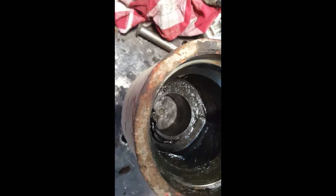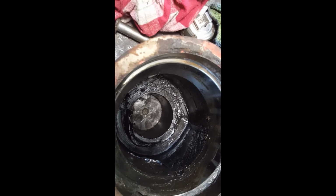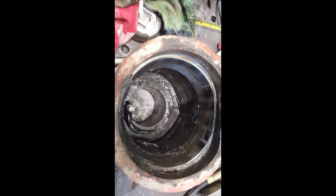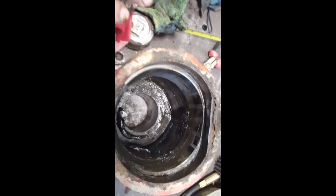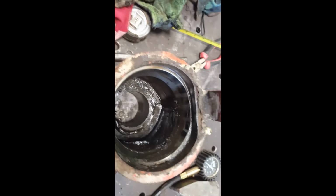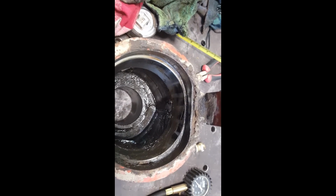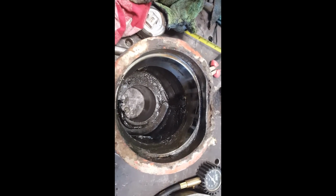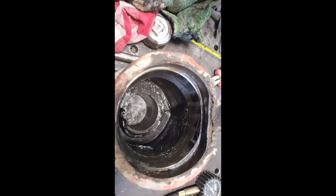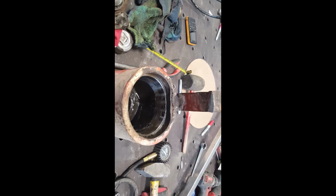Though, if that was the case, that's a 2.5 inch shaft that goes through there. Anyway, that 2.5 inch shaft would come all the way up to the back side of this bearing, and it'd never pull out again. So that's the advantage to that. And probably the quick way is to cut that off, build up with weld, and then turn what we have. But well, I'm gonna run to town and see what we can come up with, and we'll check back later to see what the plan ends up being.